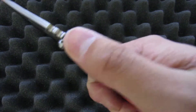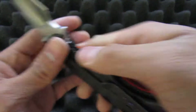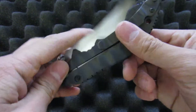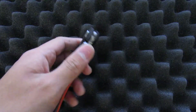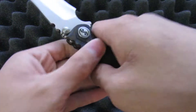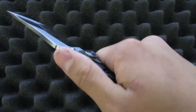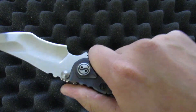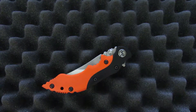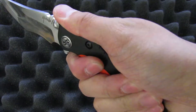The other issue is that when I grip it, you feel the lock bar moving farther and farther in — you can actually hear it too. That's the lock bar moving from about here to over here. It stops at around 50%, but it makes it much more annoying to unlock; you have to put more pressure behind it and it's just more work. It also makes the knife feel less solid in hand — I don't like a handle that feels like it moves. The bigger problem is the creaking sound, which is pretty annoying, and on a knife at this price it just shouldn't be there. To me it just tells me the tolerances on this one aren't perfect, and it makes it feel flimsy even though I'm pretty sure it's not — it just gives it a cheap feeling.